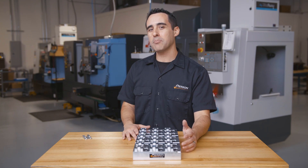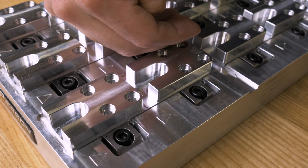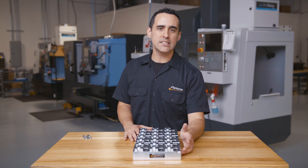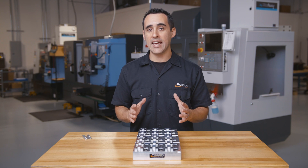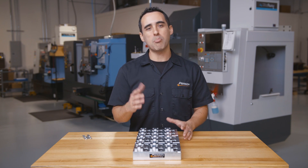The arrows are simply a reminder to the operator to slide the workpiece to the end of the pallet. This corner is a touch-off point that we use as an optional pallet origin. We machine sides for X and Y and the top of it for Z. This gives the operator a machined edge to touch off of instead of a less accurate sawn edge of a part.